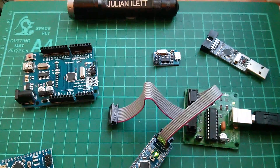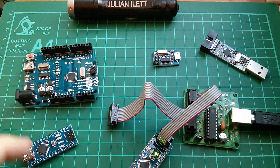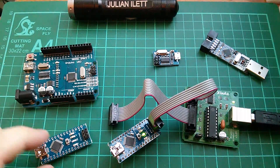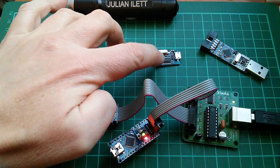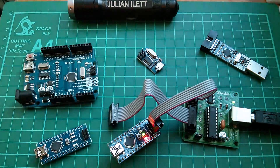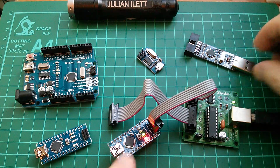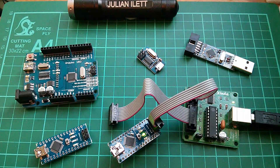I'm happy to report that having gone back to Arduino official release 1.0.6, everything seems to be working fine — including the old Nano that I was having trouble with, the second Nano, the new Uno. The new USB tiny ISP is working fine. The USB ASP comes up with an error message, but it still does program the blink program. So all much better. I guess that indicates that you've got to be careful using beta software.